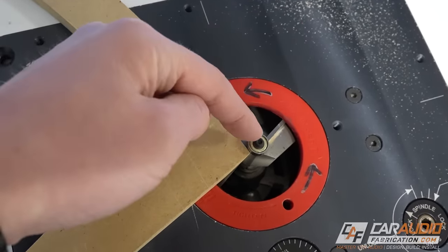When adding magnets it would be easy to get confused and put them in the wrong clearance holes, so I've put an 'M' next to everything that is for a magnet. The process for adding them is simple: I use this acrylic piece with a magnet embedded in it, attach the stack of magnets to it, and use a rubber mallet to secure them one by one into a common face. Then I flip that stack onto the opposite side of the acrylic to use the correct polarity for the magnet, and repeat onto the mating piece.